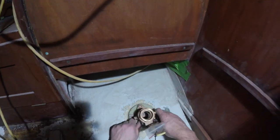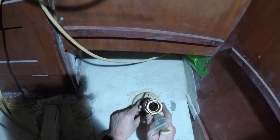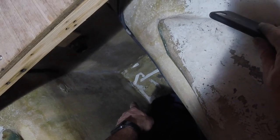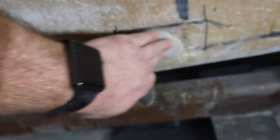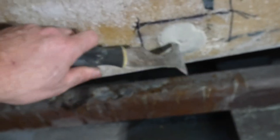Got the galley here. Yep, that's good. Lovely. Okay, don't know if you can see, but right down the bottom there is the plug, which I filled up, and what I've done is put a backing plate on the other side, and on this side I kind of skimmed it round so it's got a nice round contour down the bottom. And then this top one here, I had a backing plate on this side. It's sort of protruded a bit, but that's fine. I can easily reach this with a sander, so I can take it back. So that's looking good. I've just taken the block off here, and this is good. It's a little bit proud, but I can sand this back, and maybe just put some lighter fairing in to smooth it out, but this is really solid, so that it'll create a good base to laminate over here.